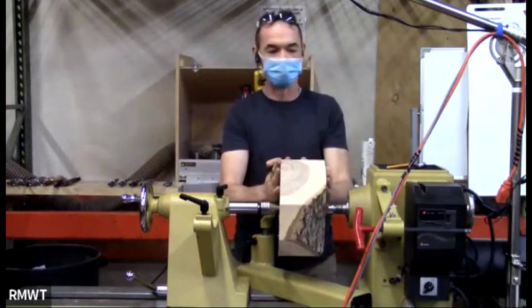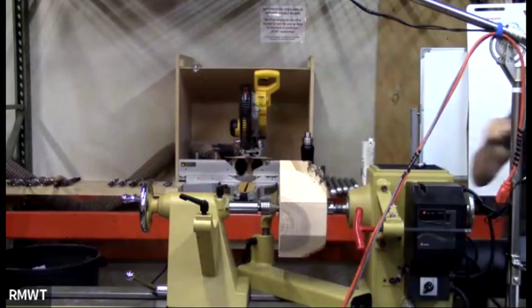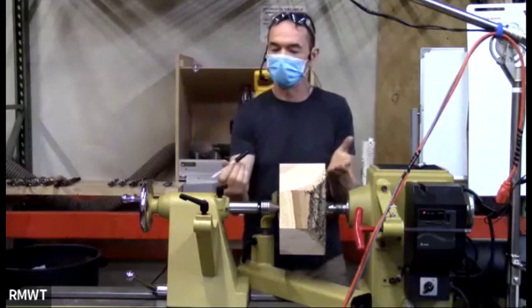So in fact, what we've got is a pencil, we spun it, and what we've got is what I call mixed grain: end grain, side grain per revolution. So keeping that in mind, that's where a lot of the problems come from. And also, there's a problem that the grain isn't fully supported like it is all the time in spindle turning. In spindle turning, when we're cutting towards the center of the lathe, the fibers of the wood are in our favor. But in bowl turning, they're not always in our favor because of the direction that we're cutting in.